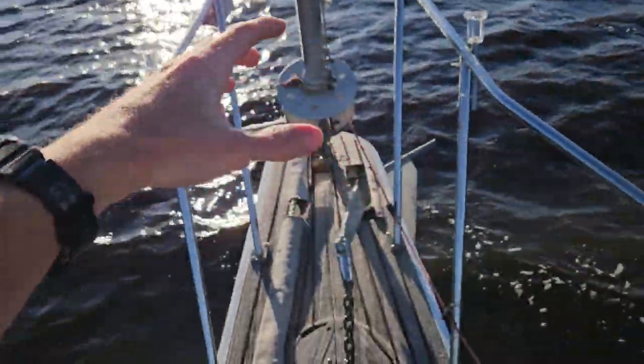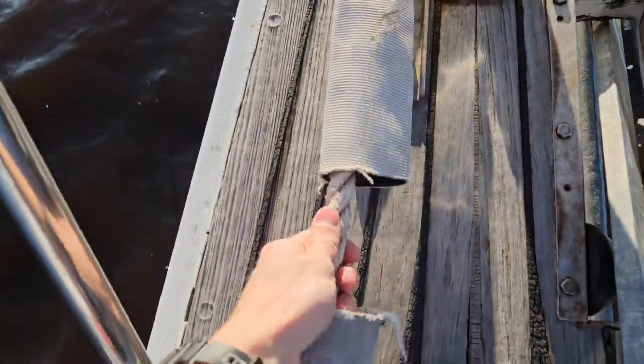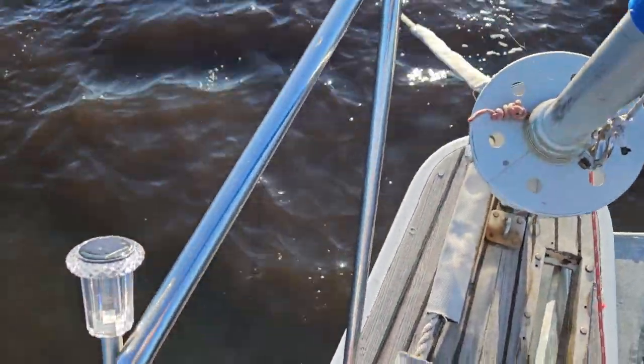the hard pan itself. And then I've got this, what is it? Half-inch rope, which is holding my boat. So the point of saying all of this is I don't care if there's a hurricane or whatever. This boat's not going anywhere. The thing that would fail is my cleat. My cleat would break before anything else. The shackles that are on that thing are 1-inch shackles that are used on like commercial towboats. I'm good. I've got more than enough ground tackle that I need. So not worried about ever dragging anchor or anything on this mooring, which is a personal mooring that I installed.